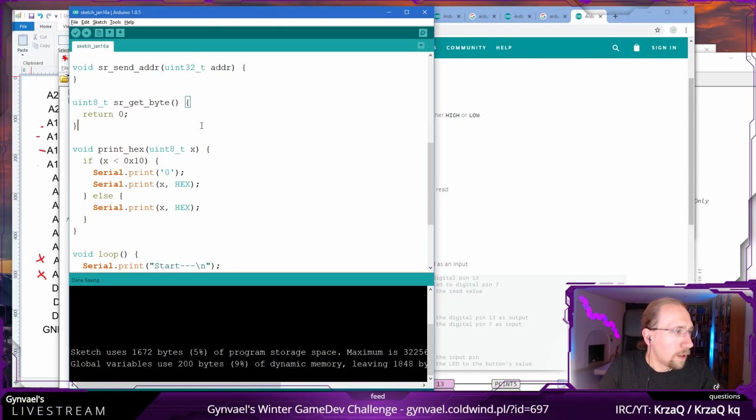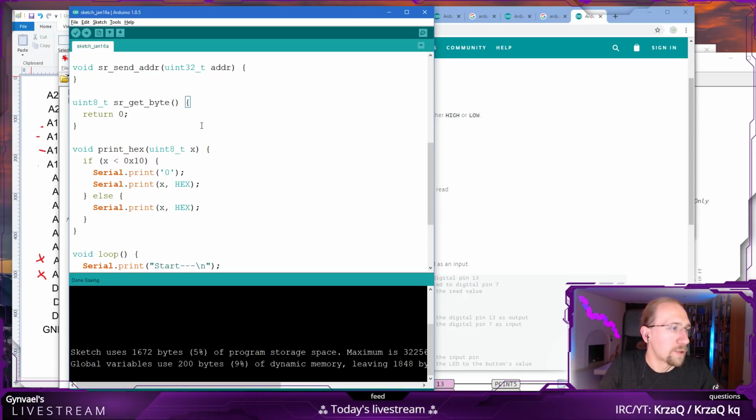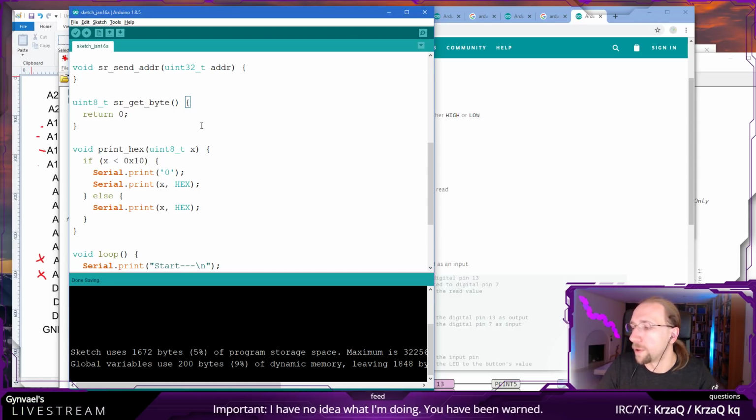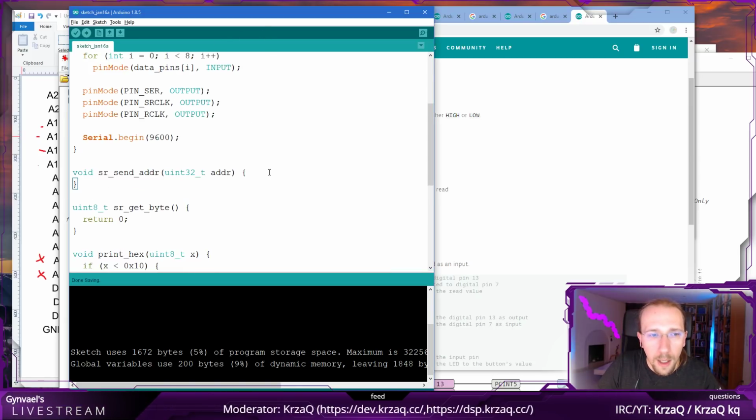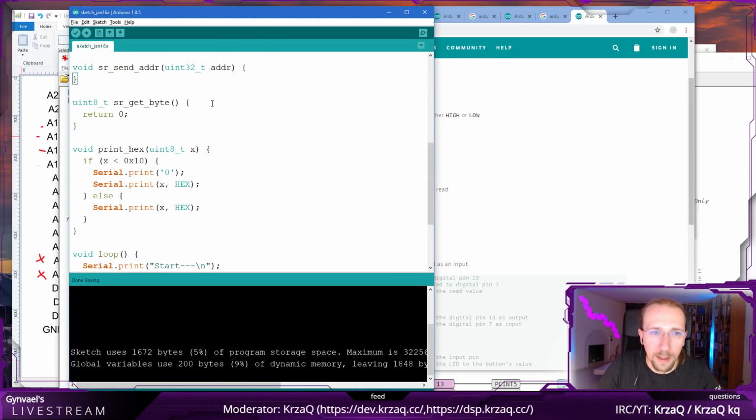Okay. Eustace says that I have to make sure to select the correct board and bootloader version. Yeah, that should be fine. And also, if something is connected to pins 0 and 1, then this can disrupt the upload, which is what I expected. So I'm happy that we actually reconnected the pins. Eustace, thank you for your hints. It's really useful.